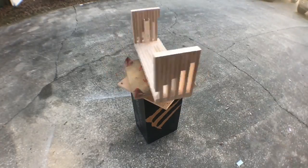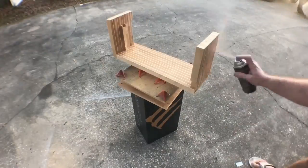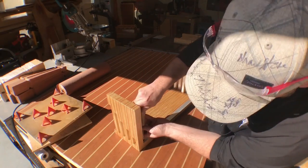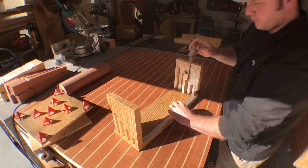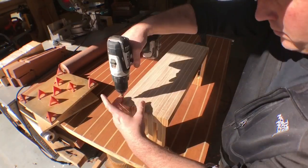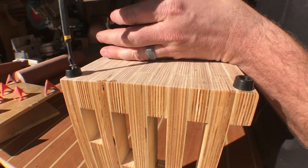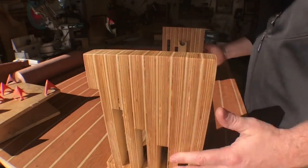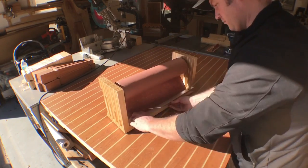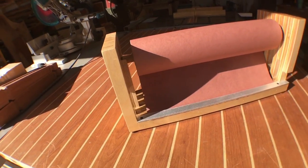This is a little lazy Susan device I made with painter's triangles — you can buy these commercially, but they're pretty easy to make. It makes spray lacquering or spray painting anything relatively small fairly easy. Now that the couple coats of spray lacquer have dried, I'm reattaching the aluminum cutter piece to the bottom. In my test earlier, I was pulling the paper and the paper cutter was moving across the table, so rubber feet should hold it in place while you're using it. Held it in place — works really well.